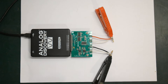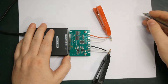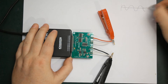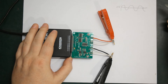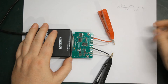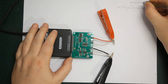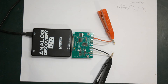By default, the measurement signal across our device under test is something like this. We have a sine wave of varying frequency, and this will be swinging around zero volts. The actual voltage is going to vary depending on the impedance, but the maximum is 200 millivolt peak to peak — so plus 100 millivolt down to minus 100 millivolt peak.